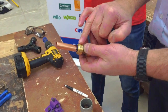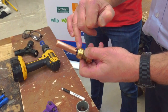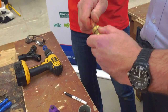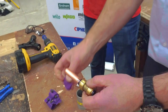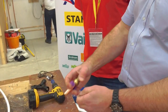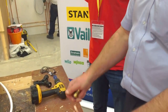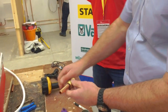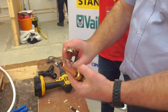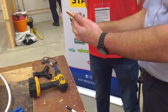You've got the depth mark there so you know that you've actually inserted it far enough into the pipe. If the pipe disappears into the fitting, the little legs are still poking out so you can't get hold of it and pull it out. When we demount it, you can use a demount clip — push it on, squeeze it towards yourself, pull and twist, and out it comes. Or there's another demount tool — large horseshoe or small horseshoe — onto there, then pull and twist, and that comes out.